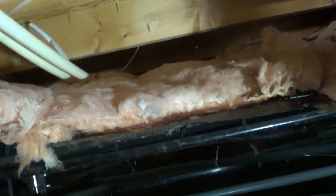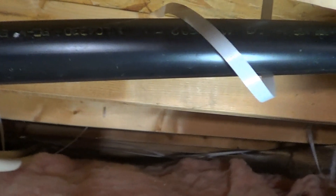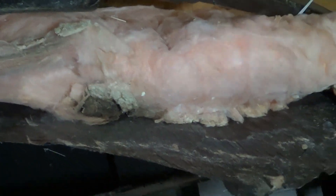Also, if we did have a leak anywhere, instead of cutting out a huge piece of insulation, we could cut out a small portion, pop our head up in there, and see almost the entire length of the home. So you want to be careful when you cut out pieces of insulation — just do small sections — because the integrity of this membrane is what keeps that insulation suspended under there. If you rip that out, you're going to have to repair it, which is a very hard job.